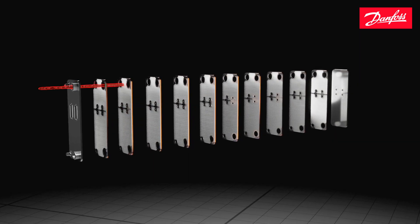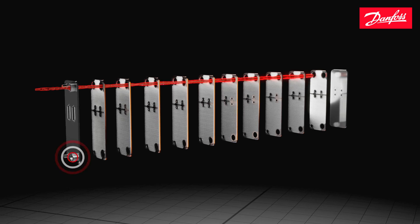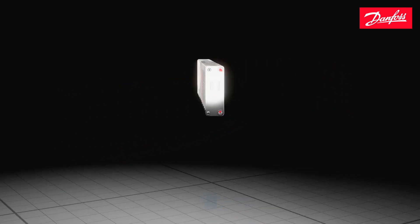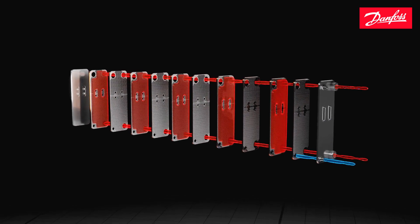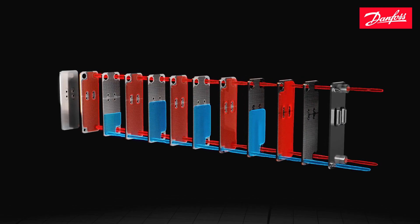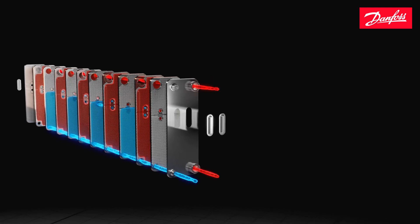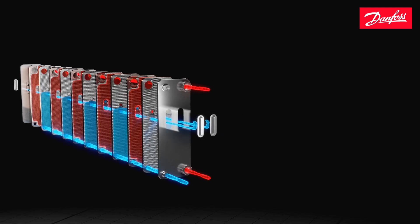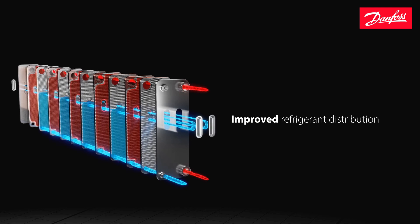The brine water flows in through the water side inlet of the heat exchanger and passes through to the outlet. The liquid refrigerant then flows in through the refrigerant side inlet and is heated by the brine water. The special mixing chamber of the H39EZU features optimized superheating regions and improves refrigerant distribution between channels.